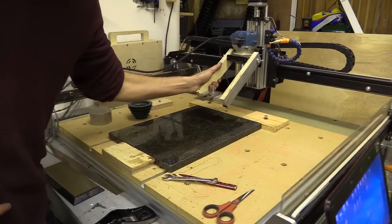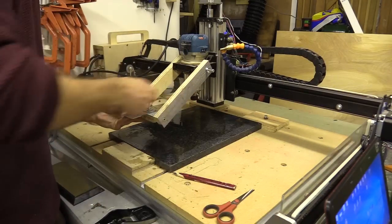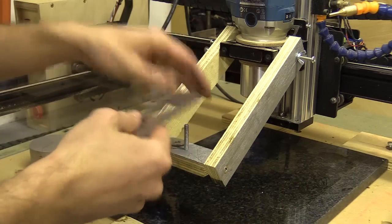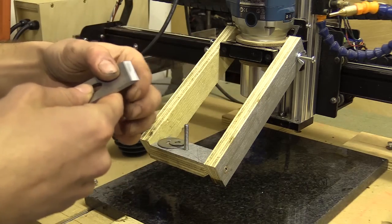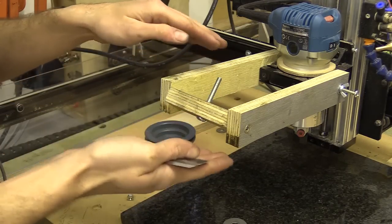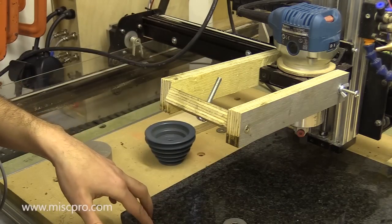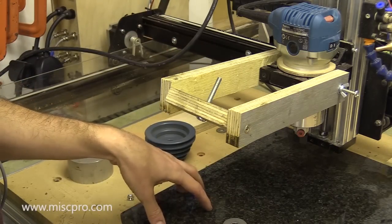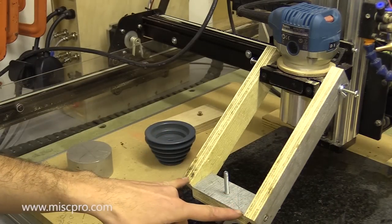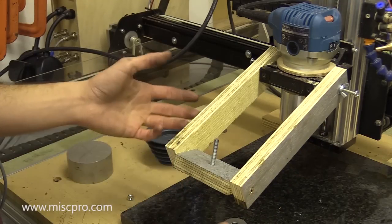I've got bored of this. I've come to the conclusion that this works in principle but the jig needs to be developed. Looking at it I can tell I haven't assembled it square — it's actually slightly twisting in the position I've attached it to the spindle mount. I also can't get the angle of this part flat enough without the bottom of the arms hitting the sandpaper on the granite work surface. What I'd like to do is redesign these parts and cut them out using the CNC machine itself, then come back to finish this particular task.